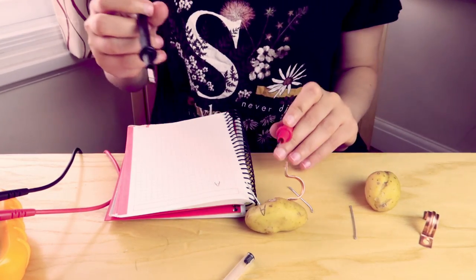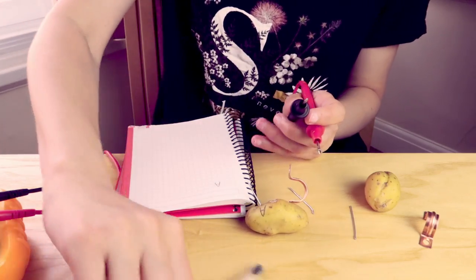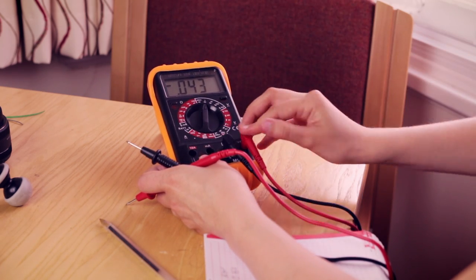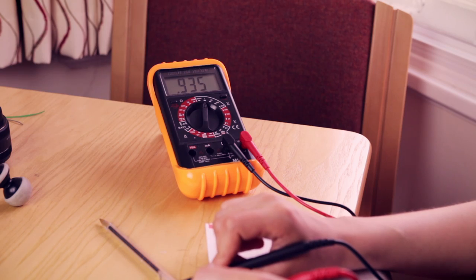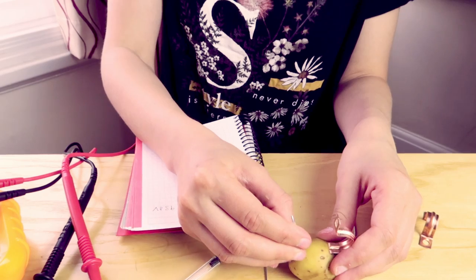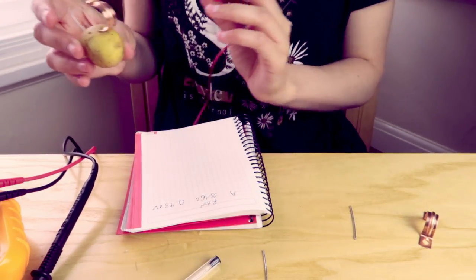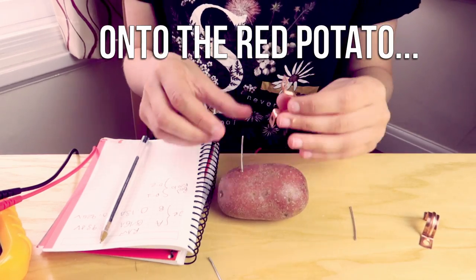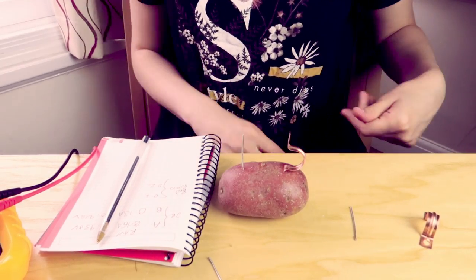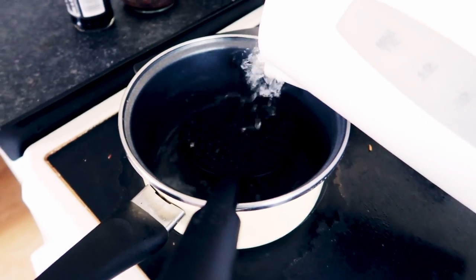The red goes on the copper, the black goes on the galvanized wire. Yeah, 0.16. I took the voltage and amperage for two Jersey potatoes and began to suspect that the length of the galvanised wire stuck in the potato might actually affect several of those variables. I decided to measure a single red potato, choosing two distant points along the potato to see if the distance between the wires would have an effect without using two potatoes. I did notice that the further apart they were, the higher the resistance in the potato. So let's see what happens when we boil these babies.